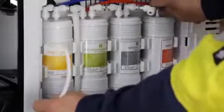When the third one is done, press and hold down on the collet ring, remove the PE tube from the third joiner. Remove the protection cap from the side water inlet of the fourth filter, connect it to the empty end of the third joiner.